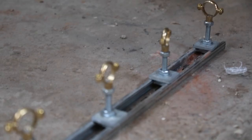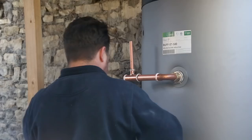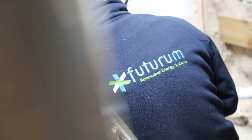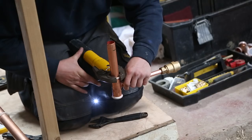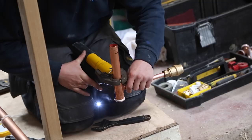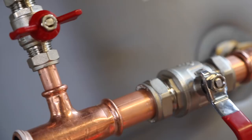Throughout the whole installation they used commercial grade fixings for all the pipework and the hangers. When it came to fixing all the pipework together, they used commercial grade press fit, which crimps the pipes and joints together, rather than messing around with soldering, compression fittings, or push fit. This is a commercial grade and really reliable way to do it. We also had the whole system valved at every single part so we could shut off and keep things safe.